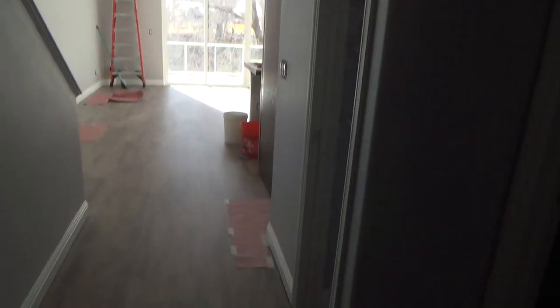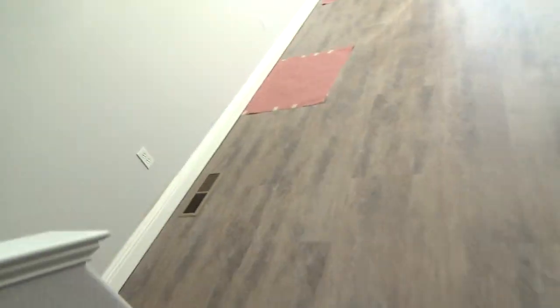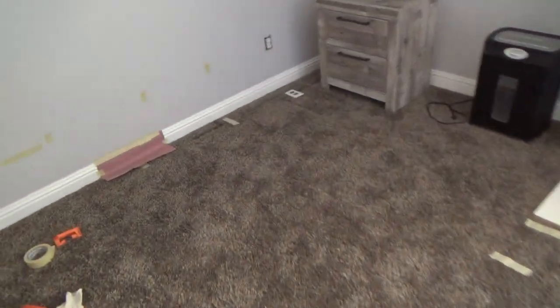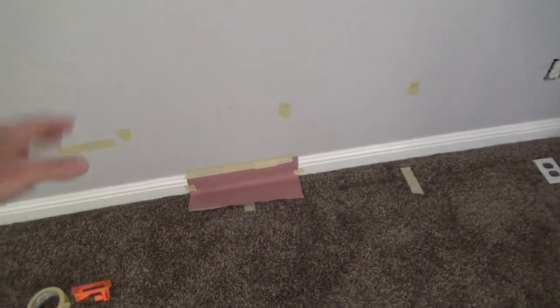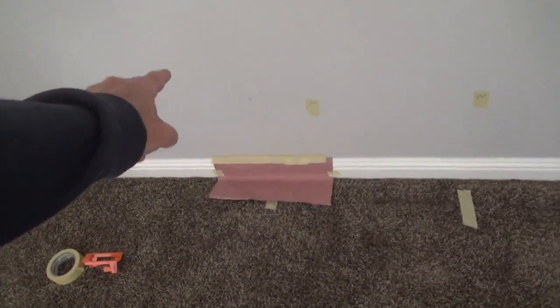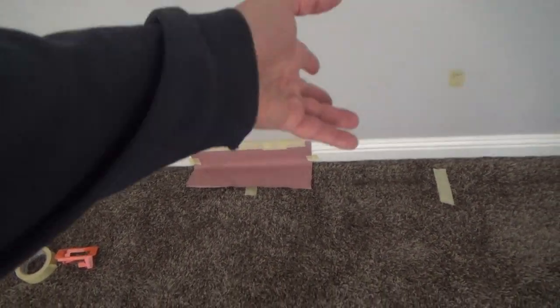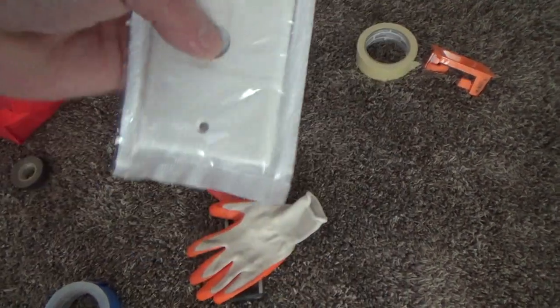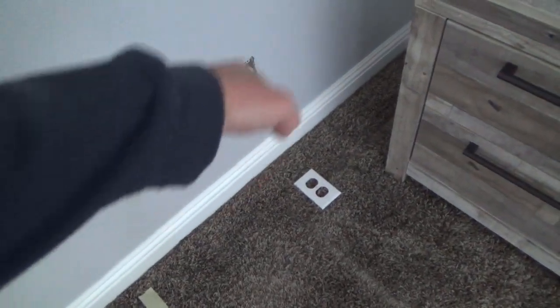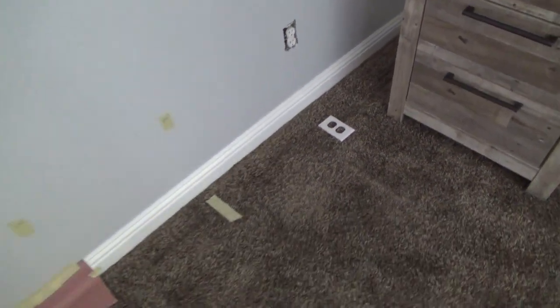Usually everything's fine — you just have to look at things, go slow, and hold your breath a little bit. I'm going to run a continuous cable. It doesn't have to come straight out of the wall — it'll come out and go down along the floor behind the bed so you don't really see it. It'll come out of the cover plate, come down at an angle with white caulking around it, then I'll fish it along the baseboard and scoot it underneath between the baseboard and the carpet tack strip.